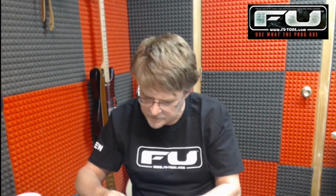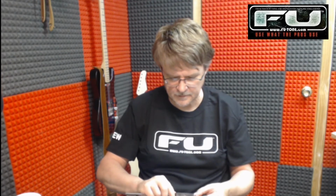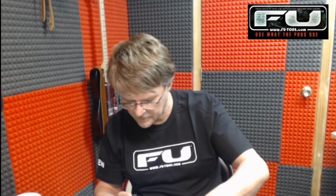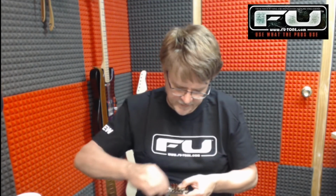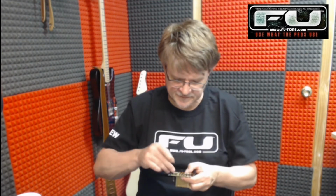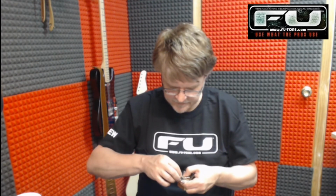So all you do is you just drop that screw in there. I'm going to tighten that down just a hair. We're going to turn on our calipers here. This one here is supposed to be at 249. And we're pretty dang close to that. So we'll go ahead and lock this one down. It's reading 250, so I mean 250 and 249, yeah, like 1 thou. I mean, that should be fine.